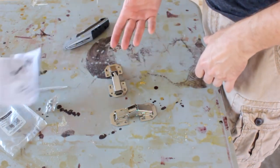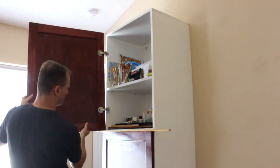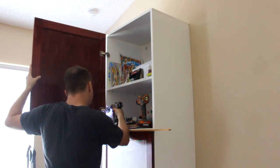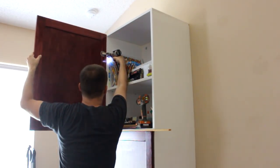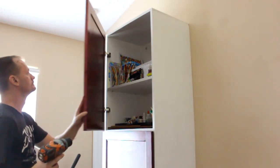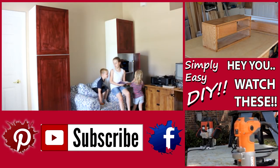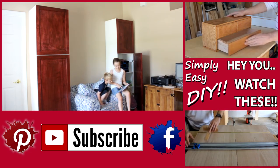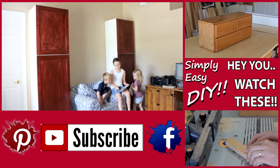I'm using some concealed hinges that do not need to be mortised into the doors. One of the benefits of using a hinge like this is it allows the doors to sit flush with the side of the cabinets instead of needing a reveal. As questions come up I'll address those over on the blog post — check the description, I'll link you from there. I think this is going to provide a nice place to keep all our homeschool supplies and textbooks neat and tidy, as well as provide a nice place to sit, relax, and just read a book — homeschool storage that doubles as a reading nook. Win win. Don't forget to check me out on Facebook and Pinterest, subscribe if you haven't, and drop me a like or a dislike. Until then.